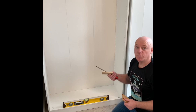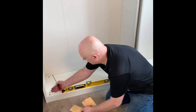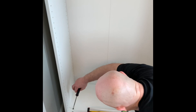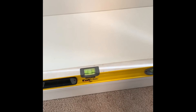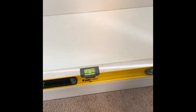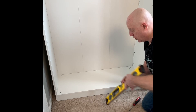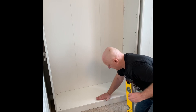Before you put the wardrobe in position, you need to cut some shims to put underneath so you get it at the right angle and it stays safe. Lift it a little bit, put the shims underneath here. Then go with your level and adjust on these screws here — down or up — until your level is fine. Just turn it until there's a little bit of resistance, then leave it. That keeps it stable on the carpet, which is always very soft.